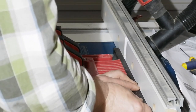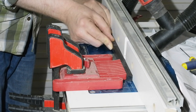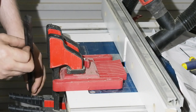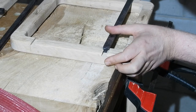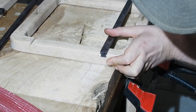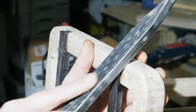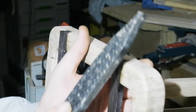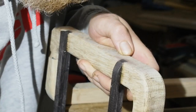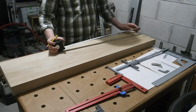Careful measuring of the tail socket is needed to set up for machining tails with a good tight fit — slightly oversizing is best, then micro-adjust to creep up on the best fit. That's a satisfyingly snug fit. As a bonus, they also serve as an additional structural component, stiffening the base of the speaker stands. Being somewhat of an afterthought, it proved a bit tricky feathering the blackwood into the already rounded-over base, but I patiently whittled away until there was a blend I could live with. As it turns out, all that was the easy part.